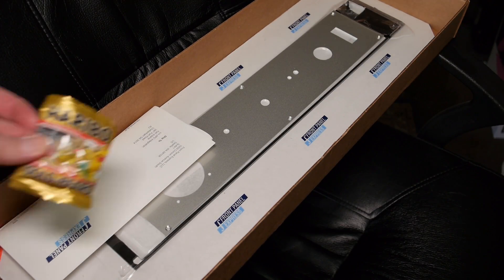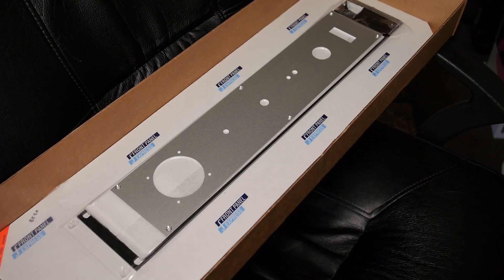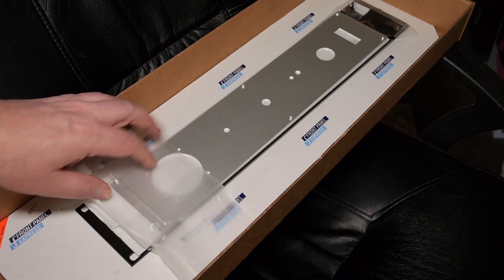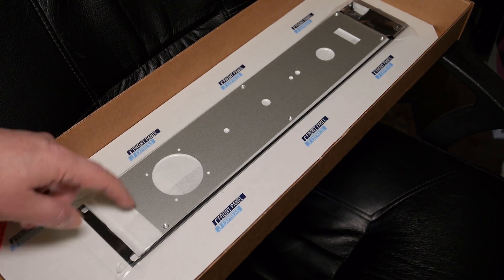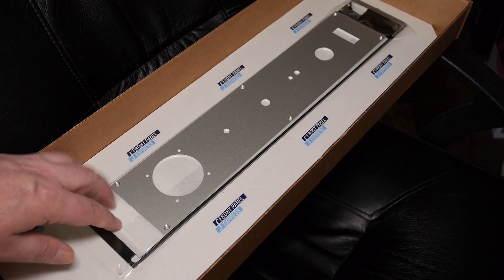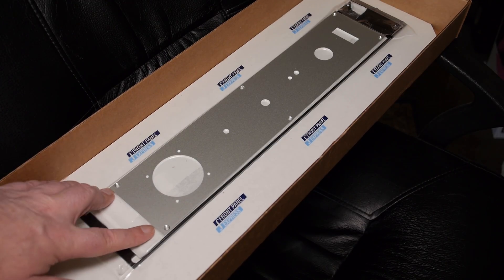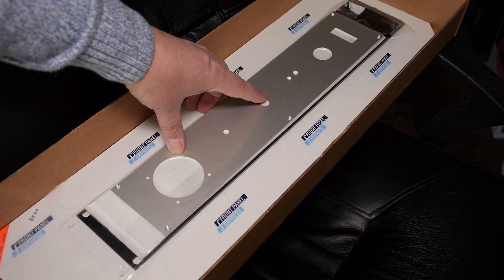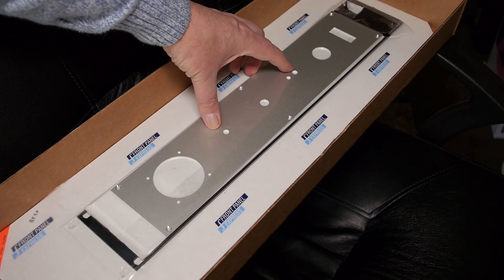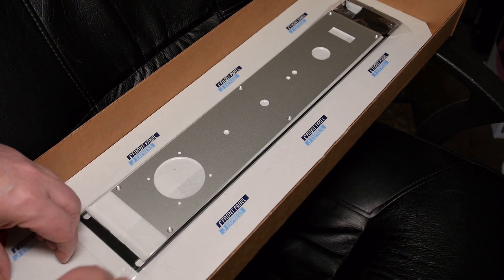Of course there are gummy bears — good ones too. So now pretend like this is a proper unboxing, but naturally I've already opened this a little bit. What we've got here is we're going to be mounting this in a 19-inch rack mount box, and we have three panels made up as replacement panels for those supplied with the box. It's two rack units high — that's the inner front panel with apertures for the meter, the gain pot, two switches, the input jack, and the power switch.